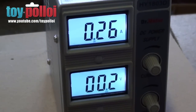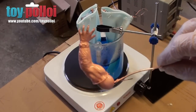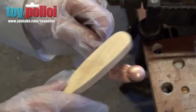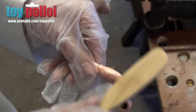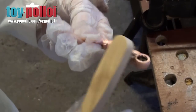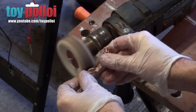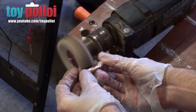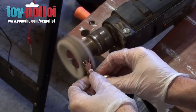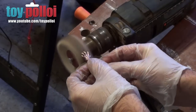The first thing I wanted to copper plate was a couple of old He-Man arms. I got those prepared — you have to spray them with a lacquer or primer, and then on top of that you spray them with a conductive paint, and everything has to be left to dry for a couple of hours. Once that's all dried, you mount it on a bit of copper and make sure you've got a good circuit going from the copper rod to your item, stick it all in the solution, and get everything lined up with the correct amount of power going through it. I'm not going to go through all the details here because it was quite complicated, but check out the Gold Solutions website if you want to find out more. My first go didn't work particularly well — I was a little disappointed — but I think that's the case with these things, you have to learn as you go. So the next time I had a spare day, I set the whole lot up again and had another go, and this time the result was much better.